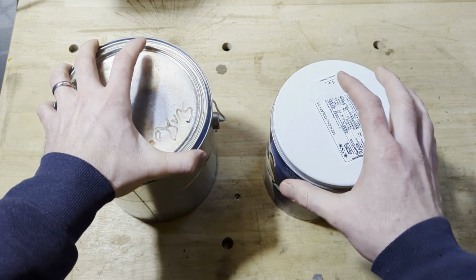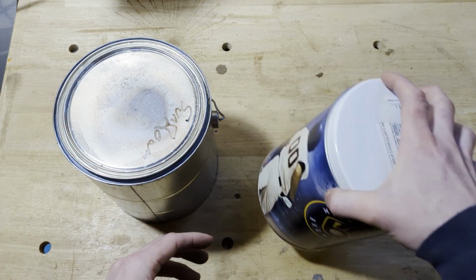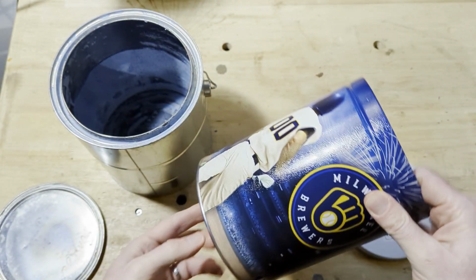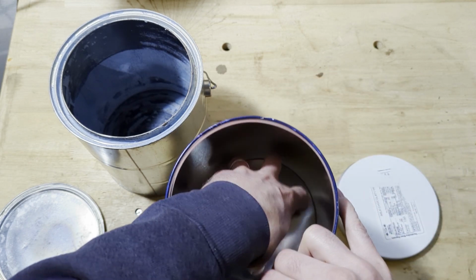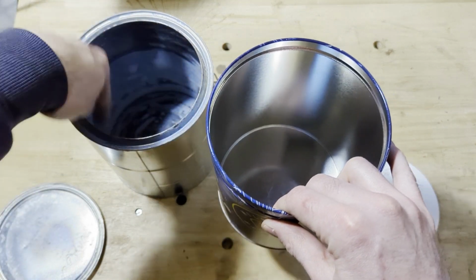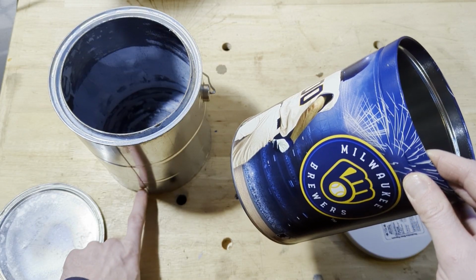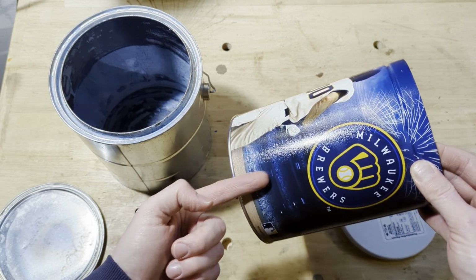So the way the smokeless fire pits work is there's an outside chamber and then there's an inside chamber. Typically, the bottom of the inside chamber has a bunch of holes in it for airflow to go up into the fire, which is built in the bottom of here. And then there's a primary fire combustion down in there. And because this is sitting inside this chamber and there's airspace along the outside and holes drilled along the bottom, air goes from the outside of this can in to the inside, and then it can either go up into the fire in the bottom, or it can come around the outside.